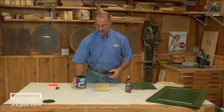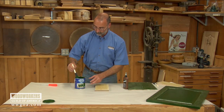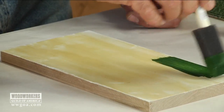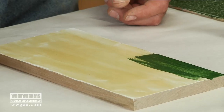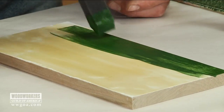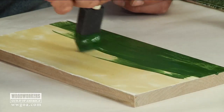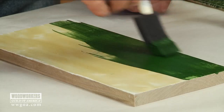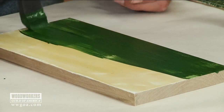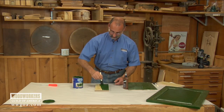Now we go to our contrasting color. The key here is don't overwork it — we don't want our brush strokes to keep overlapping and overlapping, or you may not get the crackle finish you're trying to get. It's kind of weird because normally when you put paint on, you're trying to get a nice uniform coat, but with a crackle finish that just isn't going to happen because it's going to crackle. It's hard to stop yourself from going back to touch things up.